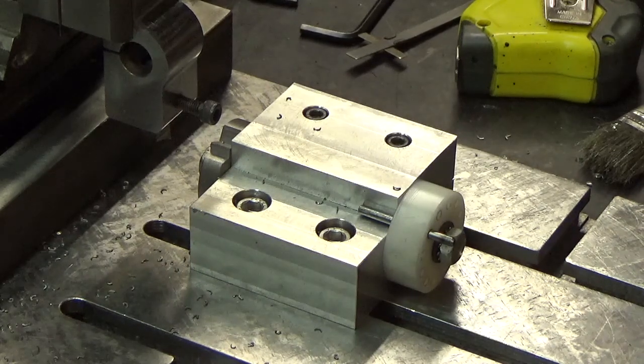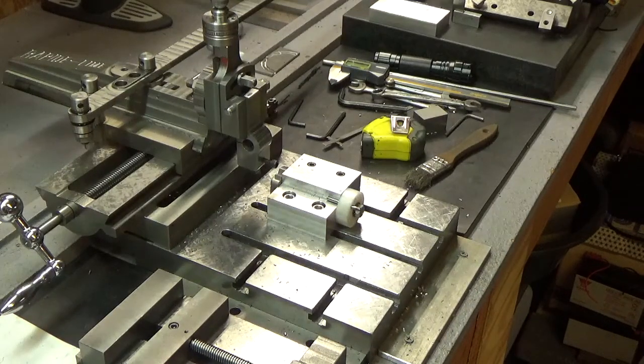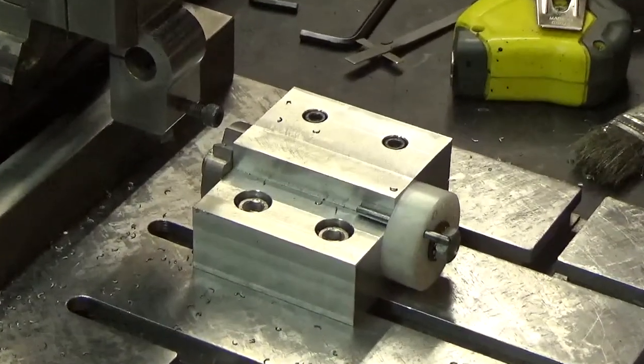You just make a blank up and it goes on the front of the arbor. I'm on the second tooth, so I've got this tooth plus another 10 to go. I'm not going to make all of these on video, but I'll go ahead and make some cuts here. I have a stop set up — you can't see it but it's on the other side — so I'm watching that stop, feeding across until I get to the correct depth, then making a straight cut down to clean up the vertical side of the tooth.